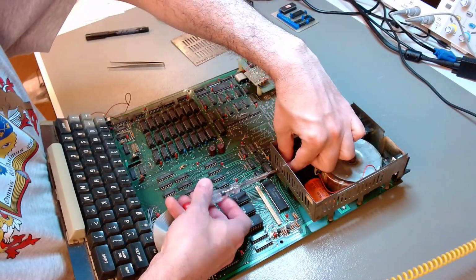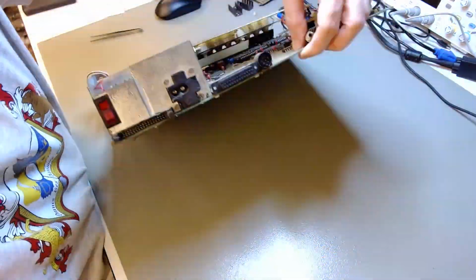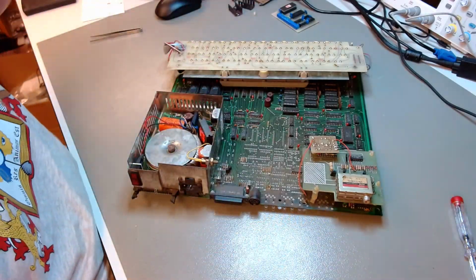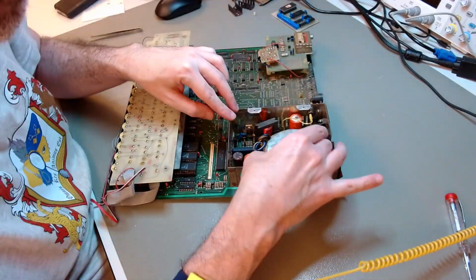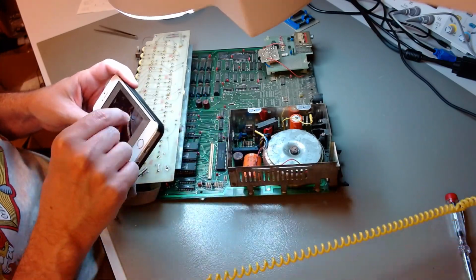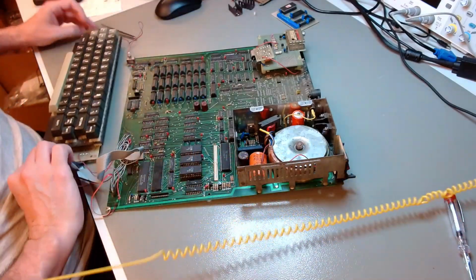There are 5 electrolytic capacitors in the power supply. 2 of them are Siemens caps. They potentially could be reformed, but 3 of them are wax encapsulated electrolytics, non-branded, and I do not trust them. They are too small to be reformed. I'm going to replace them. And then I figured I will replace all the electrolytics. There are only, let me see, 3 in the power supply unit and 2 extra on the main board. There are only a few, and I don't feel comfortable enough with an integrated power supply keeping them there, so I'm going to replace them all.